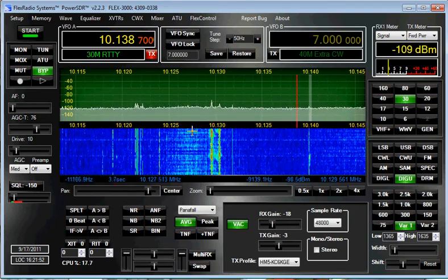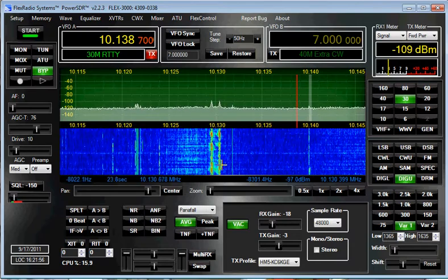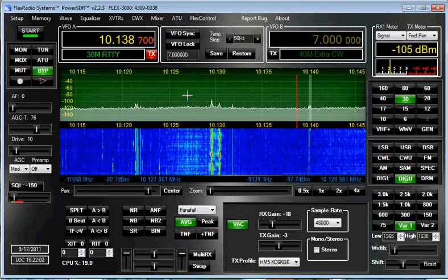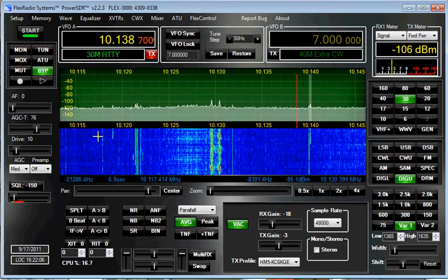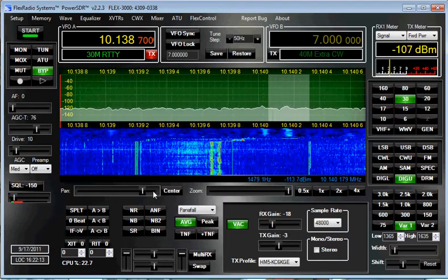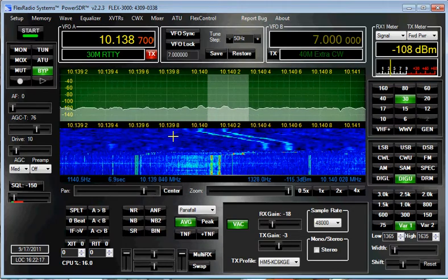This stuff here — if I was tuning to here I'd use the tunable notch filter to get rid of it. I'd probably drop a couple filters on there. This is a power supply or something filthy in my shack, but it's outside the area I'm concerned with so I don't worry about it. Zooming back in here again, getting this centered up — there is the signal in the whisper pass band right there.